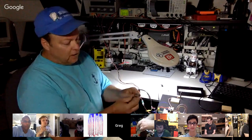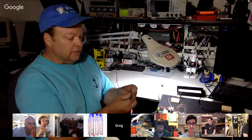The sensors for the refrigerator and freezer, which started all this, are actually the Dallas one-wire sensors, which are really handy because they're digital and they go really far from the monitor. Plus, they've actually got a little chip in there, and you can code the upper and lower level alarms, so you don't have to necessarily code that in the system. So let me fire this guy up.